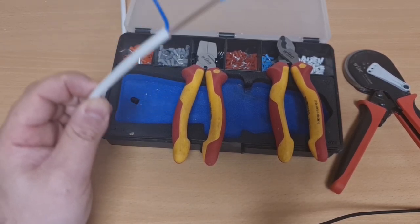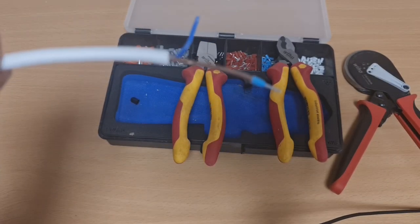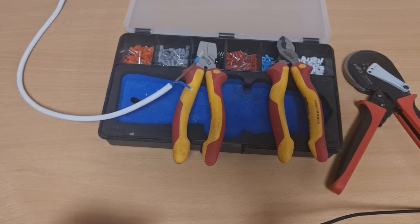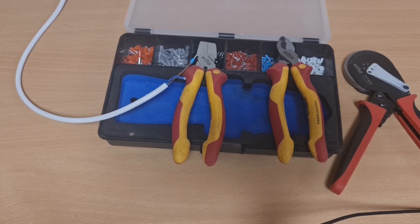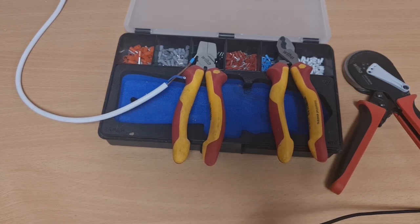With flexible cable there's also the Weidmüller croppers - you can do pretty much everything with them. I stripped the end of this just off camera with the croppers and I don't think I've marked the inner insulation. There's a knack to doing that with experience - the one thing you don't want when stripping the outer sheath is digging into the inner insulation. Some people use knives, some use dismantling tools, some can do it with croppers - it's the same for flat twin and earth. As long as you achieve the objective of stripping without ruining it, whatever suits you.